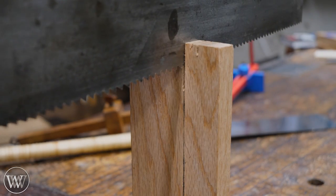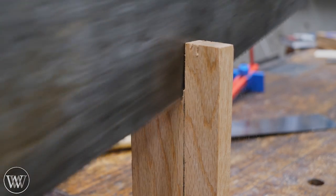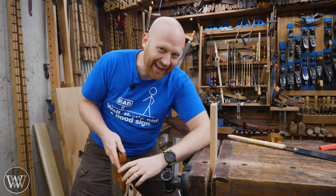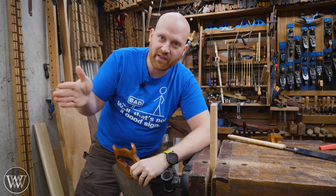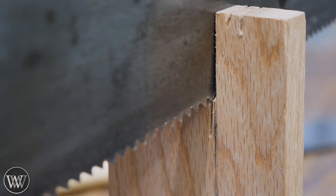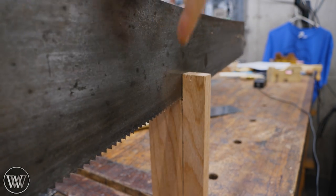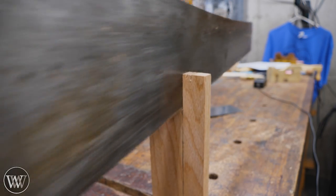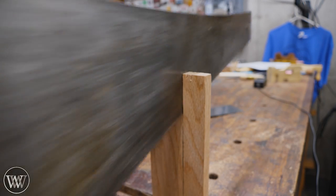I'm going to forcefully make the saw go off course and cut a good sixteenth of an inch offline. If you keep going, you'll be farther and farther offline. Most people want to twist the saw and try to bring it back into line — but that creates a curvature in the cut, which starts binding the saw, impacting sawdust, and soon you're on the other side of the line. You end up doing this zigzag thing back and forth, and every time it's getting harder to push because the curve is getting tighter. Rather than trying to correct it down there, bring it back up to where the problem started. Use the bottom horn to hold the weight of the saw, come up to where the problem was, twist the saw there, and use the side of the teeth to scratch that line back into place, slowly bringing it back down until the saw kerf is where it should be and the saw isn't binding.